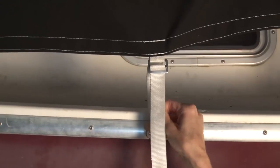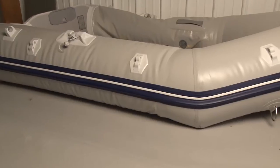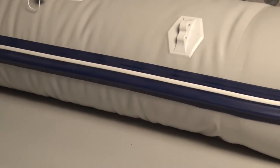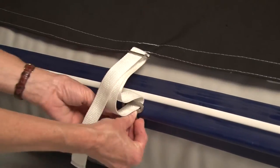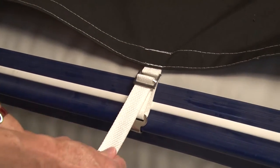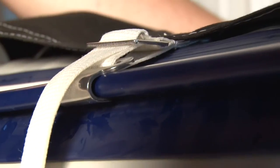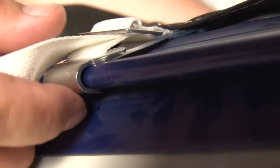You can see here we used the flat webbing hook and attached it to the gunnel of this sailboat. It can also be attached to the tow rail in the same manner. Here you can see a dinghy — we are going to attach the flat webbing hook to the rub rail. Typically all rub rails are designed in this fashion, and you can see how you can cinch down the strap and the cover to the dinghy. Here you can see the under view of the hook attached to the rub rail.